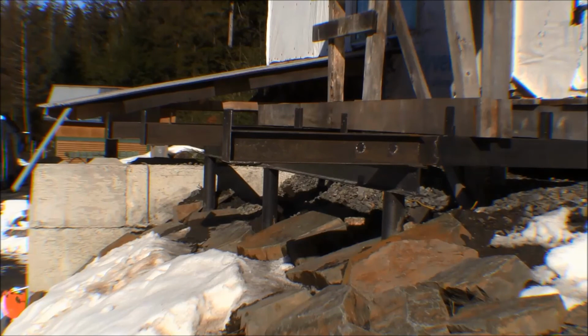It's been a couple hours since I wire brushed that. I went in and had breakfast and sat down and read the news. So that sunshine's been out here, dried up the roof. But that's about as long as that's going to heat up. Another couple hours and the sun's going to be down over the hill and it's going to start getting cold again. So I've got the Coroseal out. I'll go ahead and get that stuff painted up with Coroseal and hopefully it'll have time to set up enough to be kind of damp proof before it gets too cold.